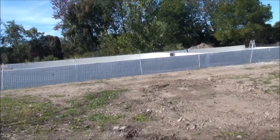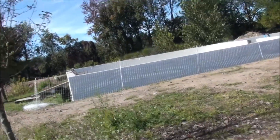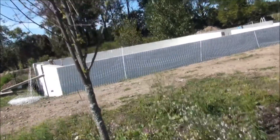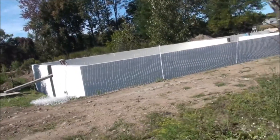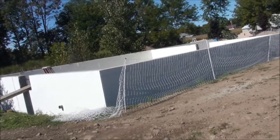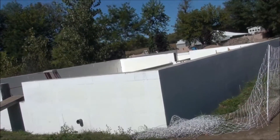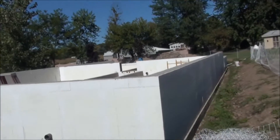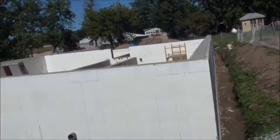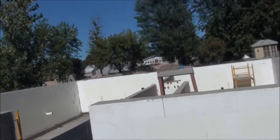So here is the chicken coop. I've got a little Premier One fence around it to try and keep the chickens from getting at the coop, since they will peck at that styrofoam. These are eight-inch concrete walls with two and a half inches of styrofoam on either side. This is a Build Block system — that's the manufacturer of the insulated concrete forms, ICFs.